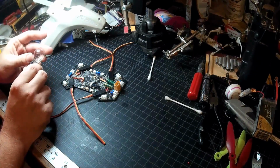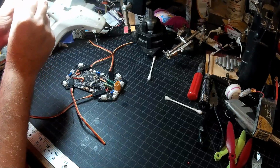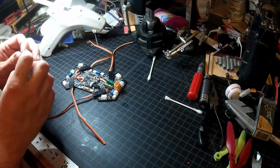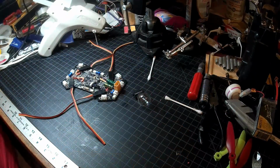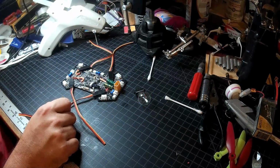And which wires come together here? Yeah, these two or these two. And we'll just wire that off as some XT60s so we can run it in line, and that will let us power this up. And if something is shorted out, hopefully that'll help protect us by limiting the current. But I'm really tempted to just go ahead and be bad idea here.